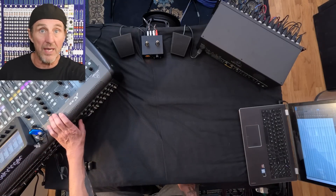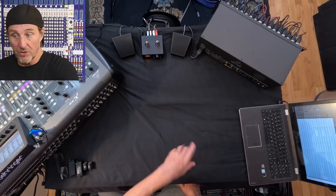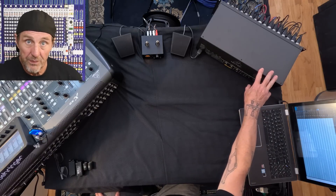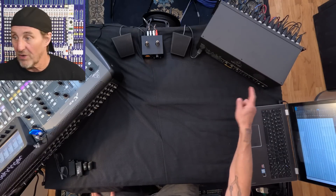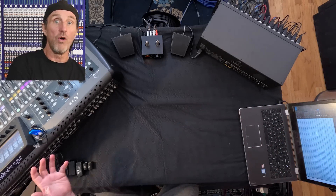Let's take a different approach and apply some extra parameters. I'm going to test some cables, extend them to the point of failure, and come up with a good idea of how much over the maximum we're going to use it — so that the cable needs to be capable of that in order to be considered reliable at a shorter distance. I've got a multi-track, 32 tracks going into this X32, sending 16 outputs through AES-50 to the S32, and then the S32 outputs are bridged back into the S32 inputs and running those back.